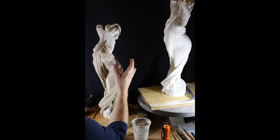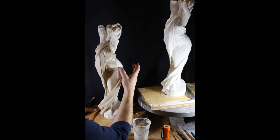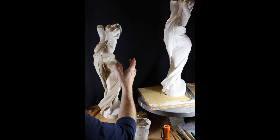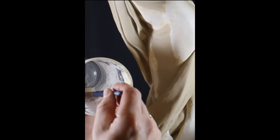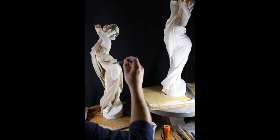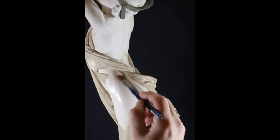You'll know for sure if you got it or not when you do a casting, but by then, you know, that may not be favorable. The truth is, even in the casting, you can still clean it up. It's not the end of the world. Where our seam line is going to be from the mold, we'll still have to clean that up. This is just less work, you know, to get it right the first time, because every cast you make after this will need cleaned up if you missed it. By this point, I don't know if you can see that very well, some of my clay has been broken down and dissolved into the lighter fluid base. But it's still in there, and I can drag at least a little bit over the plaster and kind of replicate brush marks to just make your surface look more homogeneous with the texture. So that's what that's about.